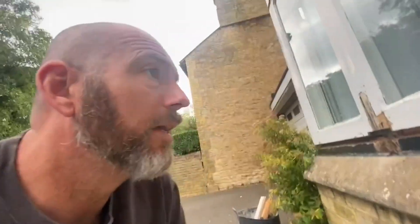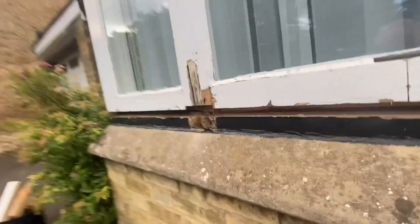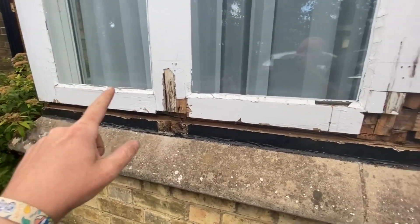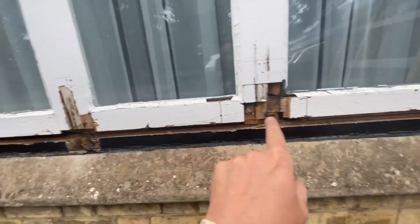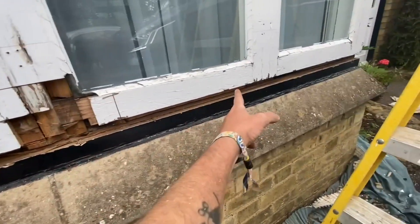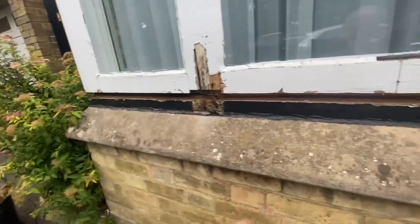I just need to show you what I've done. When I was talking to camera I thought, just get the track saw out — so I did. I put a cut line in with the track saw, but I haven't done it straight end to end with a long rail. I've got an old rail with sacrificial holes in it. The long rail isn't actually straight all the way across, so I put a string line across and it shows how far out it is. I've just done each section individually because each one is its own bit with its own measurement.